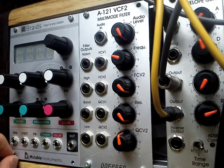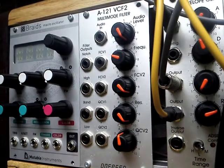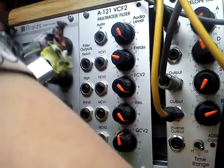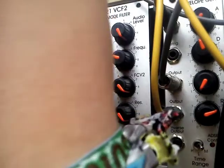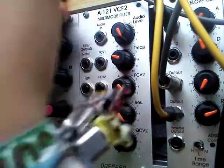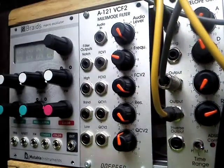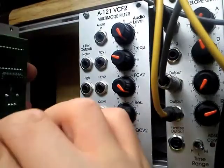So this can prove quite useful for — if you've got a fairly simple power supply that is only spitting out a bipolar pair of power rails, then you can actually get that third plus-5 supply off your plus-12.